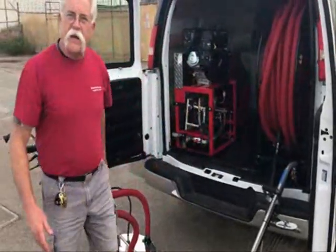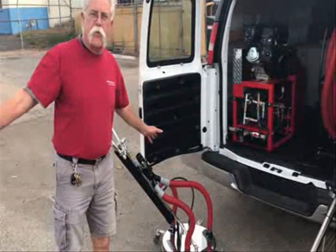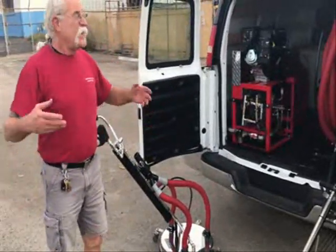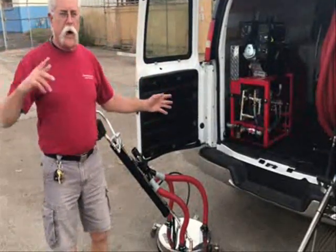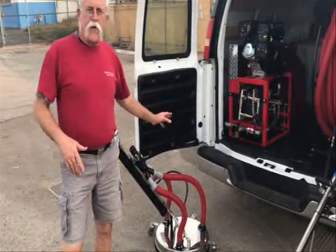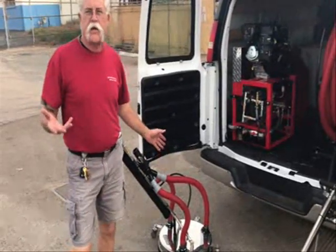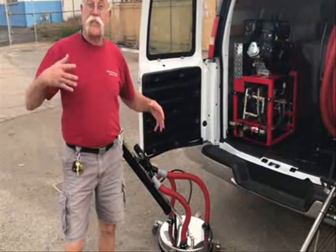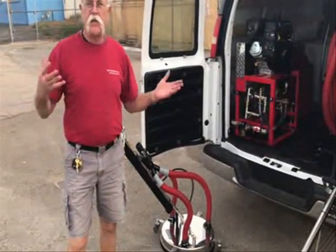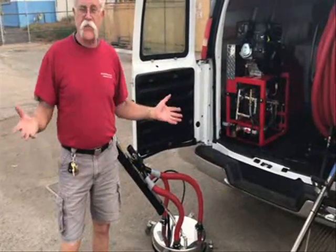She's got a 21-inch vacuuming surface cleaner for doing sidewalks, driveways, warehouses, tile and grout in commissary production style. At about 3 to 3.5 gallons a minute, she's going to have well over 200 degrees — almost 230 degrees. So she'll be able to steam and disinfect tile and grout floors effortlessly, as fast as she can move.